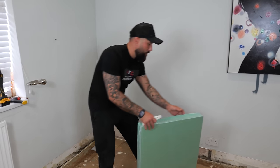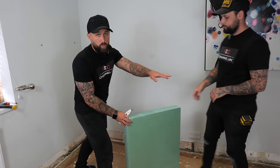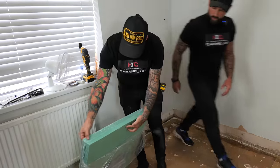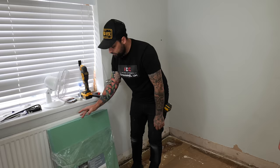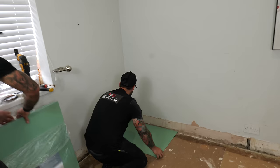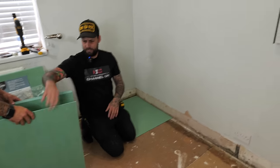When it comes to laying fibreboard we like to stagger the joints. We usually come off one of the longest walls but we have to keep them straight otherwise they'll get twisted as we lay. When you open the pack we've left the back section of plastic on so when you lean it up against stuff the green fibre doesn't rub off on your paint - little tip. All we do is take our boards and lay them out in a brick edge pattern.